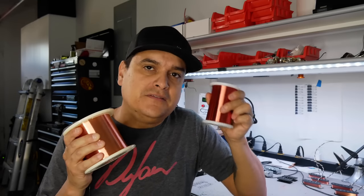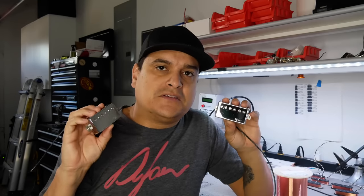This can be misleading. This roll of wire and this roll of wire can be wound to the same DC resistance, but because they are different gauges, the pickup will sound completely different. This is 42 gauge wire and this is 43 gauge wire. These two humbuckers sound completely different even though they are the same DC resistance but have different magnets. Understanding those various facets of how a pickup is put together can really help you figure out what tone you're looking for.